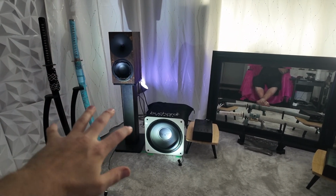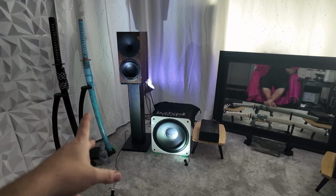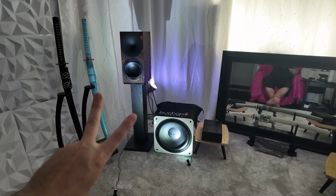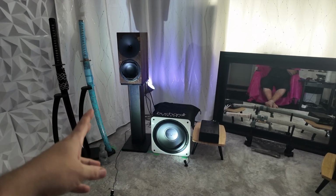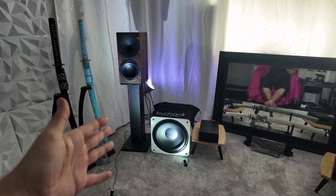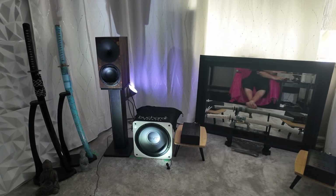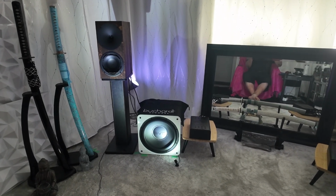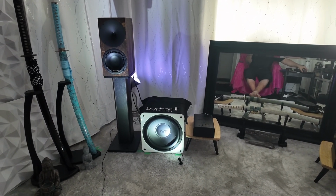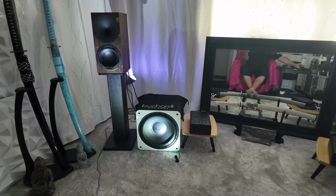The inputs are XLR analog, which goes into the DSP, which means it's going from analog to digital and then back to analog through the amplifier. So it's two conversions. The wireless transmission would just be digital to analog through the inside. So there's a potential there for it to sound different. I have to test that out. Someone in my comment sections was asking about that exact thing.